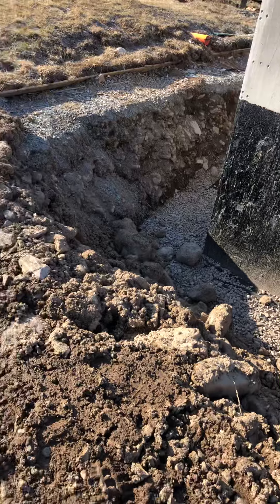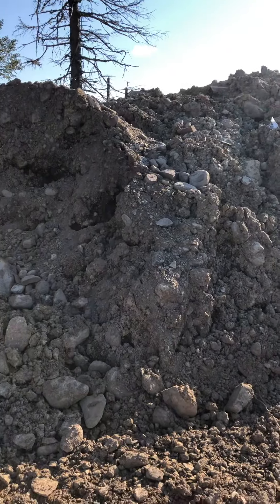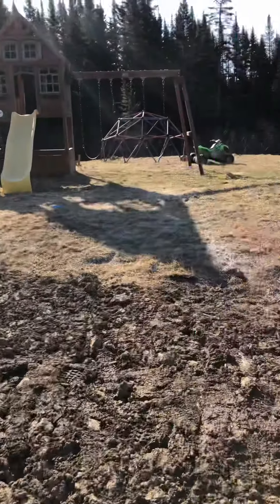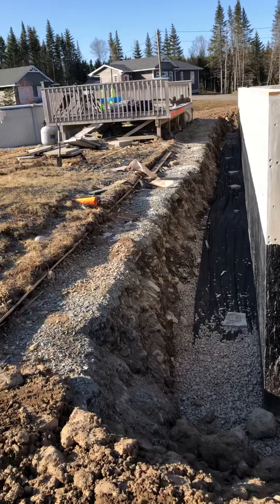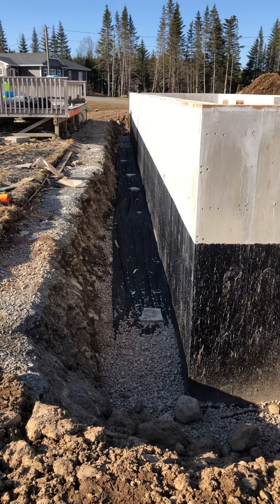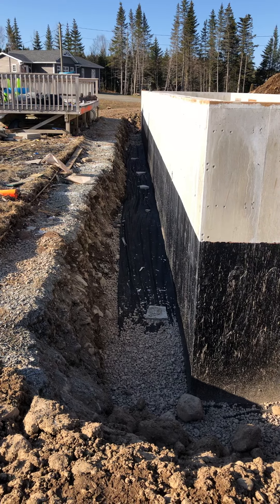In this particular home, under this ground here is another pipe that runs back on the other side of that pile of dirt — which will disappear — and takes any water that comes up through the ground or down through the ground. In this site there is a possibility of a little groundwater coming up, so we've taken some extra measures to deal with that.